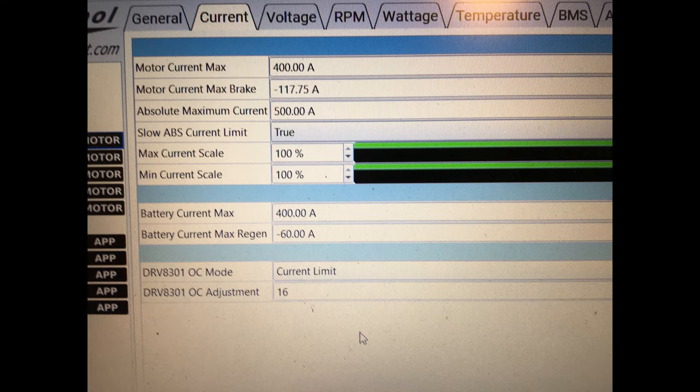I've also added a line to it — I haven't done the spreadsheet yet but I will. I've actually got kilowatts output so it can sort of verify that against the input kilowatts. Obviously it's not going to be spot on; there's going to be a lot of efficiency losses through the actual setup like the chain drive and stuff. I had to put a big sprocket on the hydraulic motor because it kept cavitating — that hydraulic pump isn't designed to be run at the high speeds the motor puts out, like 3000 RPM. It's more of a slow-turning one, so I've had to put a big sprocket on there to slow it down. I've made all those adjustments in the equations in the Arduino script, so everything should still be exactly the same as if it was linked up directly, though some efficiency might be lost.